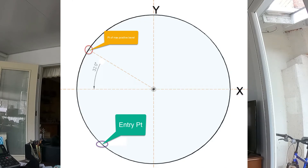This is what it will look like. You want to rotate the point where the greatest bevel occurs in the shortest direction to line with the x-axis. You can either measure the angle or just eyeball it. You then must rotate your plasma torch about the z-axis by the same amount and direction. We now must determine how much and in what direction you need to rotate the torch mount about the y-axis. You need to measure the bevel where the greatest bevel occurred and directly opposite on the other side of the round coupon.